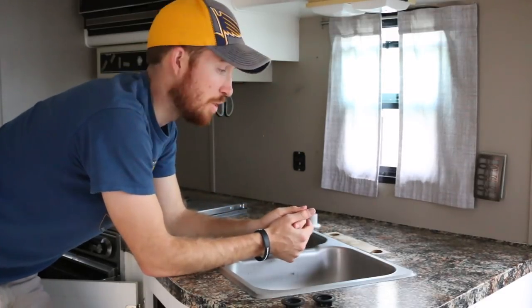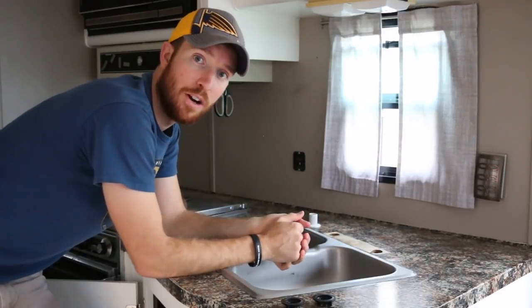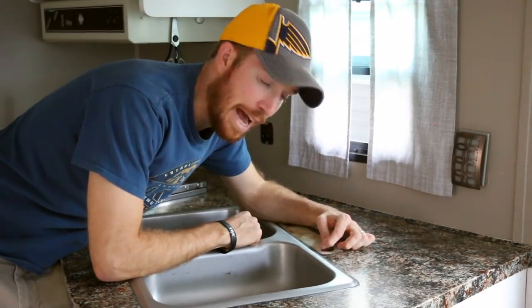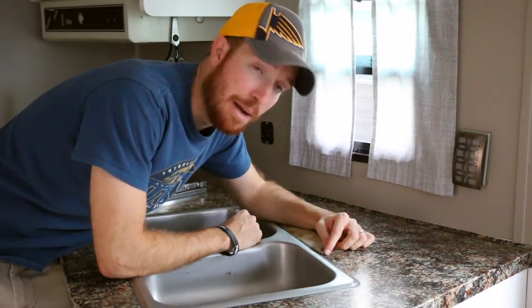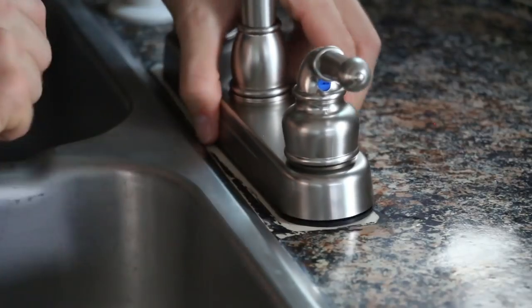Now I'm going to clean up the area, make sure there's no more silicone, so I can reattach the new faucet and put a new bead of silicone around it. I'm using my fingernail to go around the original faucet outline and take off all of the old silicone, crumbling it off — because silicone does not stick to itself. So we need all the old silicone removed so the new bead actually adheres to the countertop. I'm also being careful because we used a Gianni granite countertop paint on these countertops — that's the reason for the color difference you can see here.